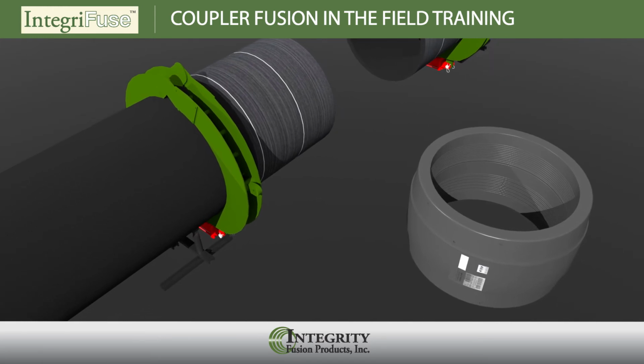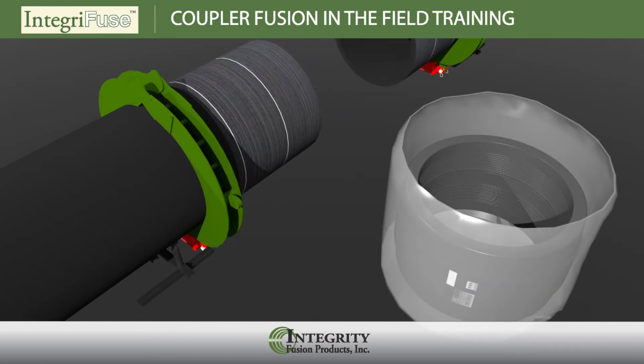If the prepared area is not to be assembled immediately, a plastic bag or plastic sheeting material can be used to cover the scraped area on the pipe, and the coupler can be placed back into its original plastic packaging until the assembly is to be made.